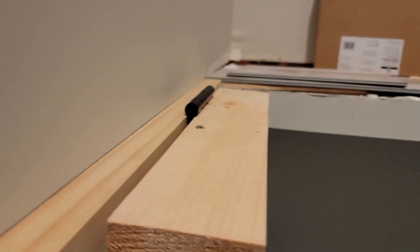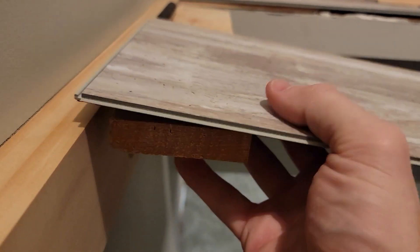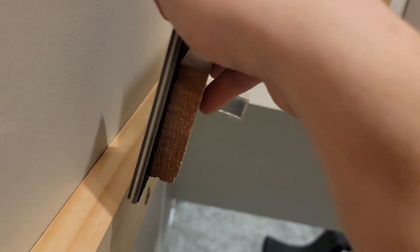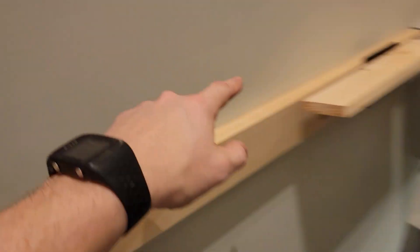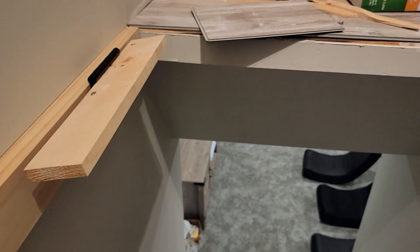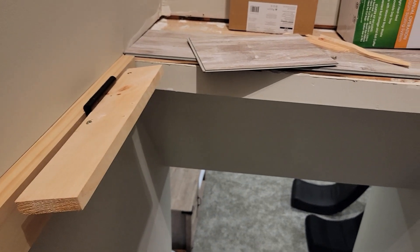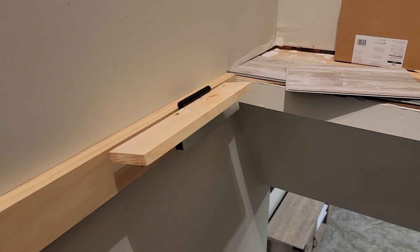I'll have a little gap, but once I have my flooring on, I'll probably hold it all the way back to that seam and just notch it for each hinge. That way, when it comes up, it'll sit against the wall. I actually have enough room to continue my baseboard all the way across here — so when the floor is down, the baseboard will sit on top and it'll look relatively normal, like a normal floor trim. We're going to move on to the main frame.